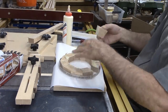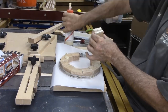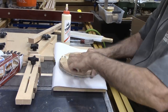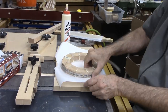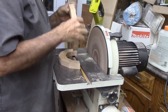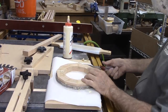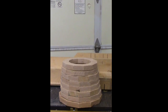For this project, about two-thirds are good enough to glue up all at once. This ring needs the half-ring method. I mark two opposite joints with masking tape so I do not glue them, then spread glue on all the other joints and put everything back in the band clamp. Before clamping, I put a small bolt in each of the joints without glue as pivots, then clamp it down. After they're dry, I make pencil marks on the two mating edges, do a light sand on the back so it lays flat, and sand off the pencil marks before returning to my glue station to glue the two halves together. I have to repeat this process 22 times, though fortunately about two-thirds do not require the extra work.